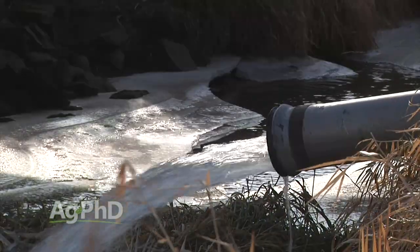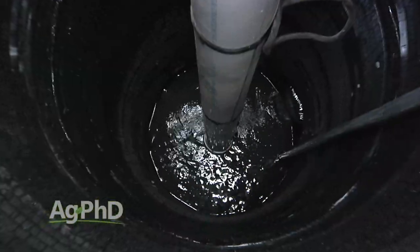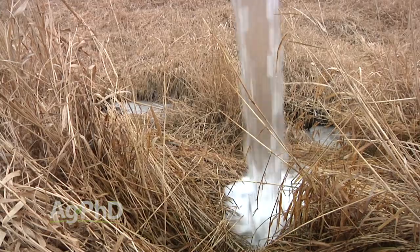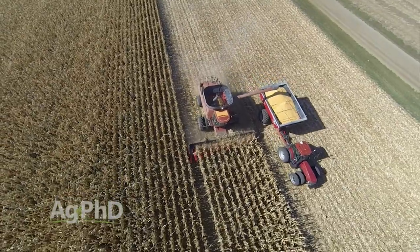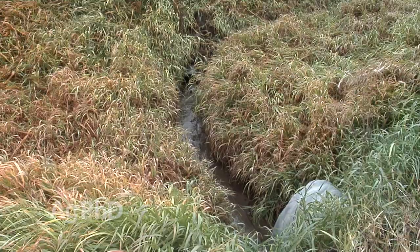The big question is: do I really need to do this because it's going to cost some money? On flat ground, tiling basically isn't even possible if there's nowhere to run the water. But if you can create some natural slope with that drain tile, bringing it down to a sump in the field and then pump it up and out, you can actually drain that field. We have one example on our own farm — one of the wettest fields in our whole county. As soon as we put tile in that field, it has literally almost doubled in average yield. It's been unbelievably tremendous.